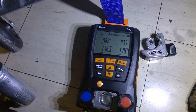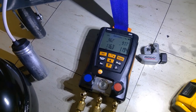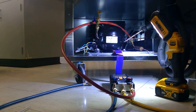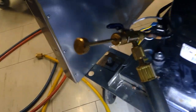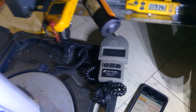Performing a standing pressure test. The system equalized at 116.3 and 119.4 psi. I check in 10-minute intervals. Came back — pressure hasn't changed. We're all good. I'm letting the nitrogen out now, removing the schrader valve with my core removal tool, and pulling an evacuation down to 500 microns.